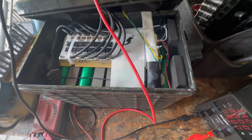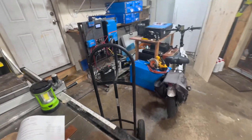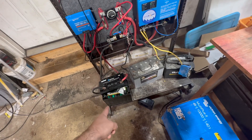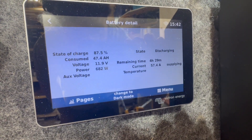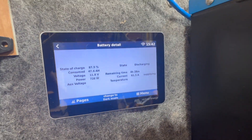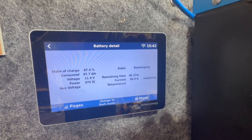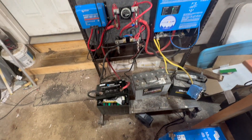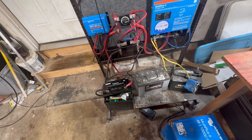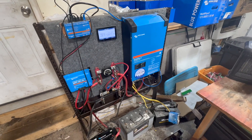We're actually running a capacity test on this first battery since it was fully charged — we are at 47 amp hours consumed. I'm just running a little space heater as the load. We'll keep running that and at the very least get one good battery to the customer. The voltage is dropping — let me take a look at what it actually reads at the battery itself. I've got leads jammed into the heat shrink tube and we are actually at 11.98 volts.